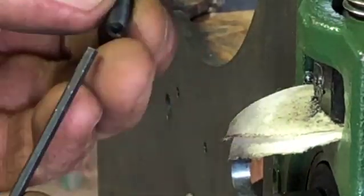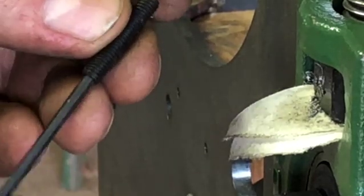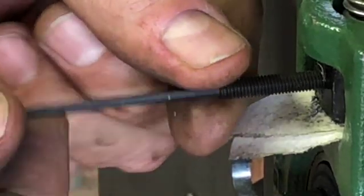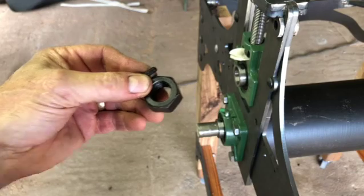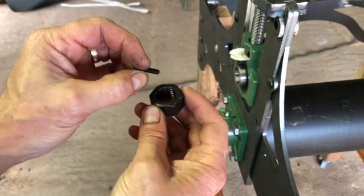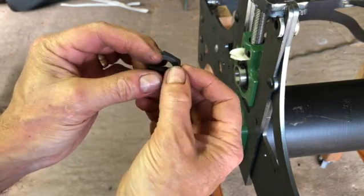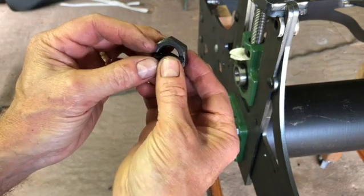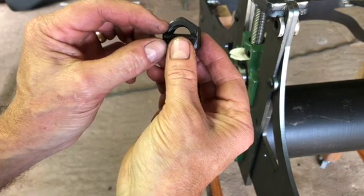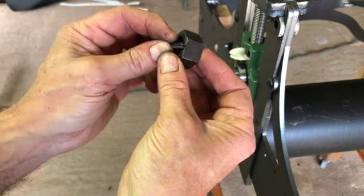What I have here is a grip screw — a long grip screw that can be put in with an Allen key. So that goes into that hole. Just before I put in this grip screw, I want to show you the length of the grip screw versus the nut. It's just shorter than that length, so I didn't thread all the way through with the tap.